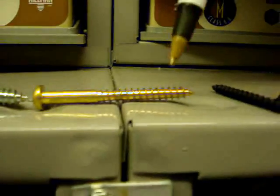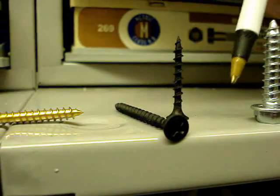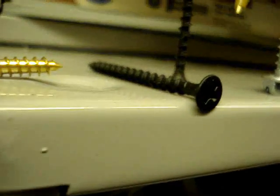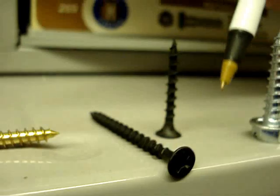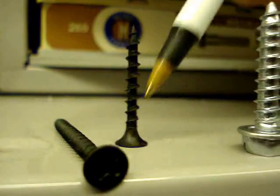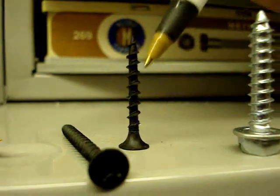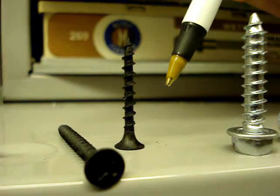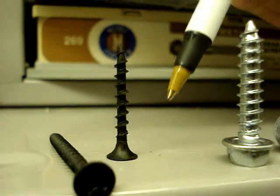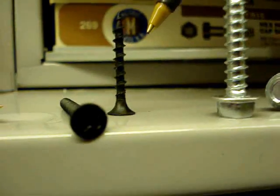Now, another screw that's commonly mistaken as a fastener is a drywall screw. Drywall screws are usually Phillips-headed, threaded all the way, and usually have a very coarse, fast thread. This screw is preferred by a lot of installers of cabinetry and shelving because they're hardened, strong, and have aggressive thread — very steep and thick — so when you install them, they zip in fast and hold things really well. They have a thin shank, so sometimes they can be a little weak for different projects, but it's a very handy screw.